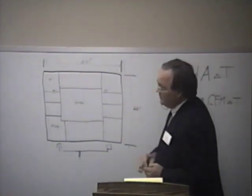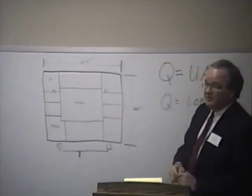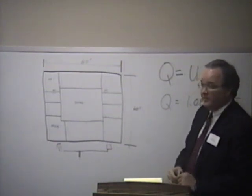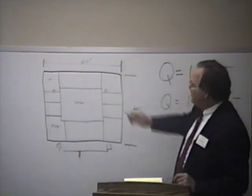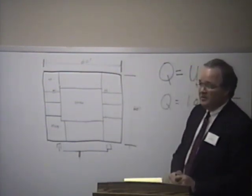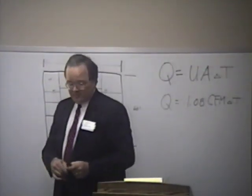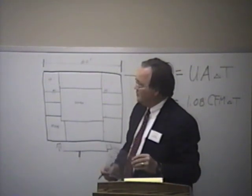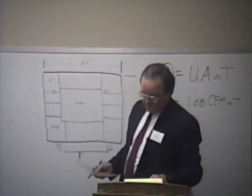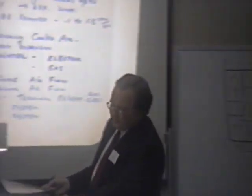There is another design. Instead of using a hot water coil, it would turn on a little fan that would pull air out of the plenum, and then we circulate more warm plenum air, and then somewhere in the plenum you have to provide heat to the plenum. But an expansion on variable volume system is the way most buildings are going today. Some form of a variable volume control with terminal reheat or plenum heat recovery. There's some pros and cons on the plenum systems because of the maintenance requirement that you have to get involved with a plenum fan and having filters up in the plenum and having to get up there.